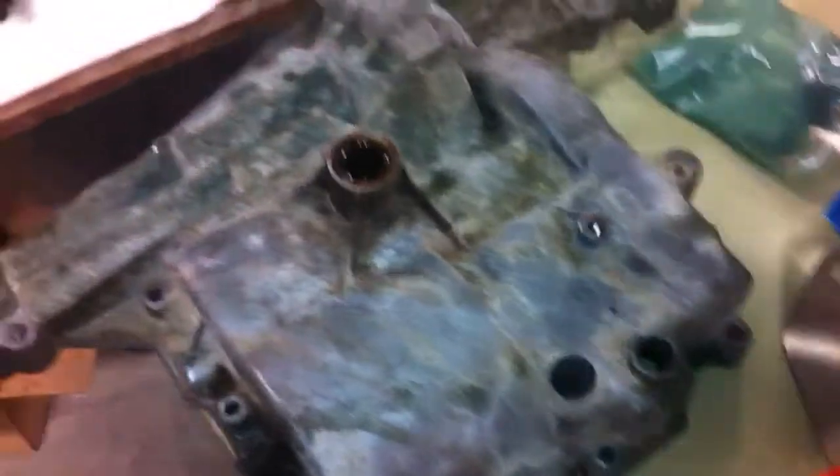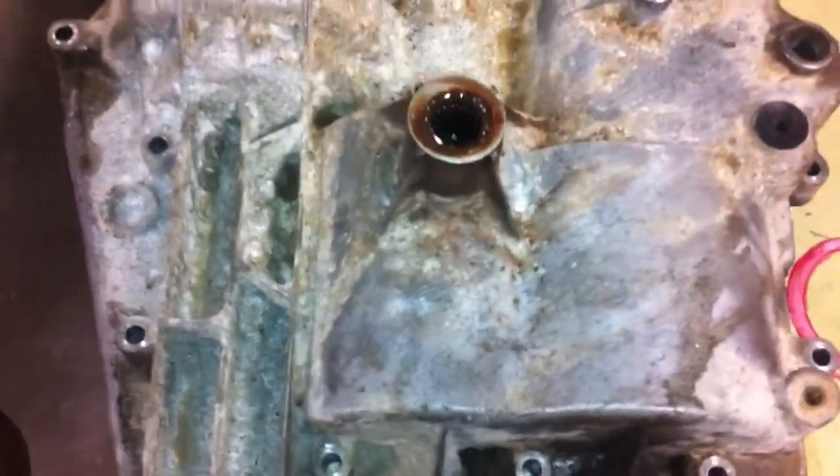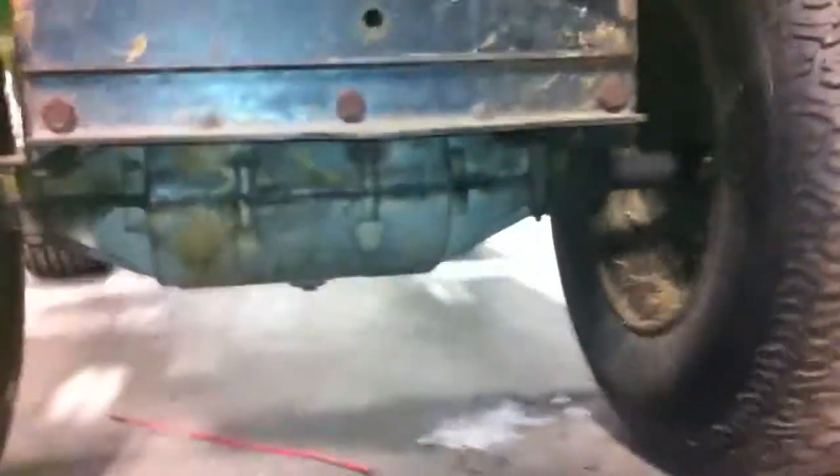That's another plan too. There was some rusty nasty stuff in there for the input — the shaft looked good though. Right where you see the mark, you can put a grease fitting; that thing's got plenty of meat there, wouldn't be bad to put a shot in it. I welded a boss on the bottom of the case because I wanted to put in a drain — to drain the case, since I converted this over to gear oil.